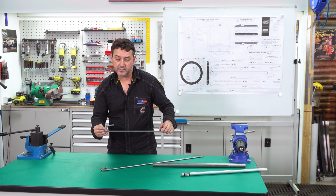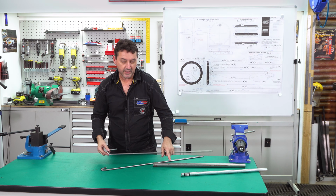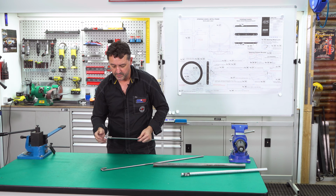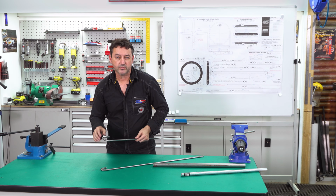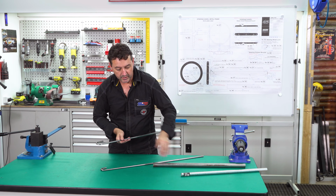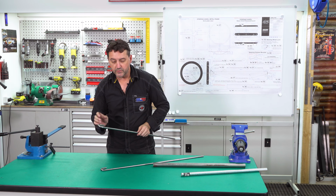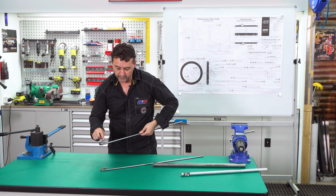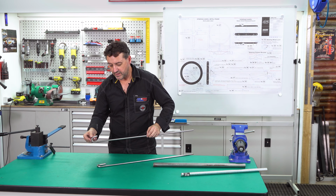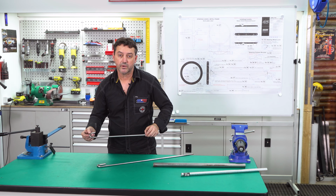This is one we've just finished making in the vise using our 30mm round bar. You could even use slightly smaller, say 27mm round bar. The last few pieces of radius we've had to manipulate a couple of times, pinch point, etc., leverage, using our pipe. So you're going to find it's a little more problematic. We've got a few marks from the vise that we're going to have to clean up. However, this came out of the flat bar bender, good to go.